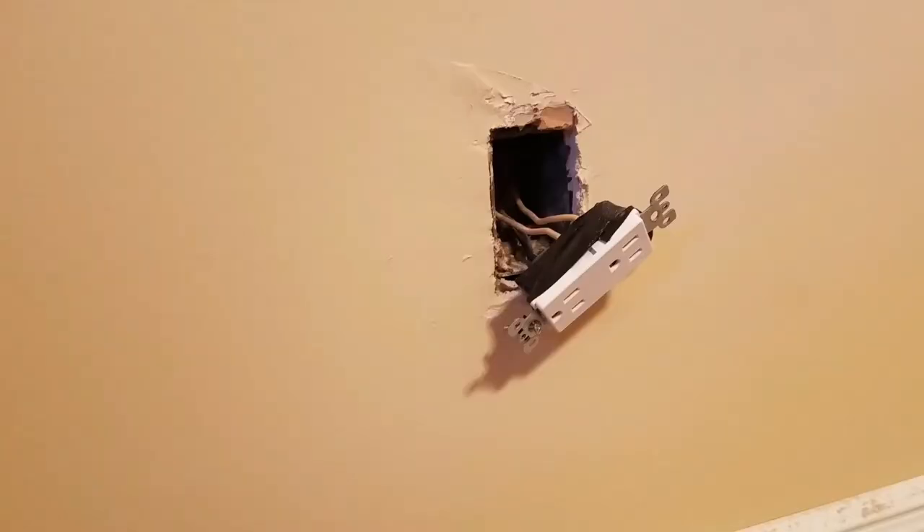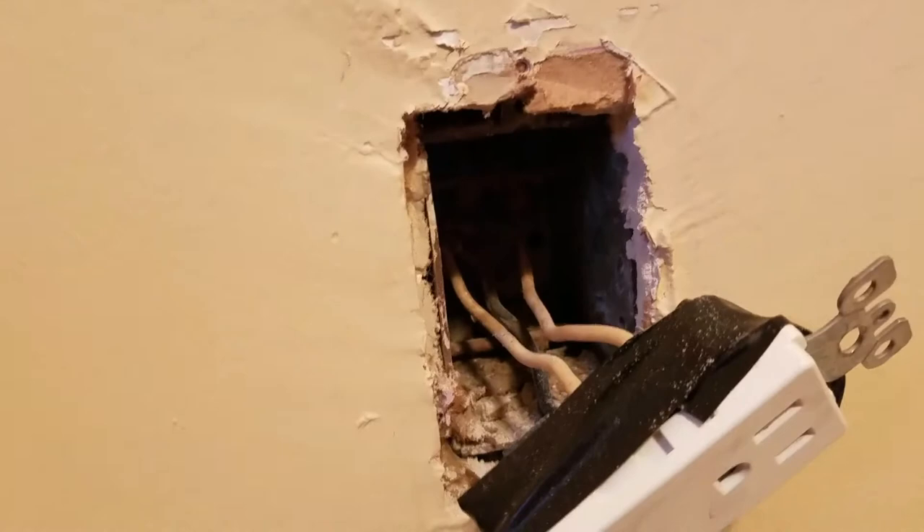Took the outlet out, taped it up because it's live and it feeds half the house. What you want to do is remove this Romex bracket — that's the box you have that just holds the clamp. The wires go through the top. What you want to do is send a snake in one of these two holes to go up the wall and make sure there is or is not a cat to get to where you want the outlet. If you feel uncomfortable at any point, shut it off. But I was an astronaut in my previous life, so I feel extremely comfortable.